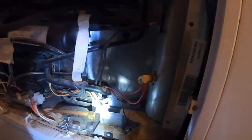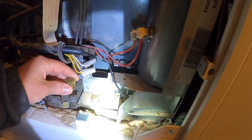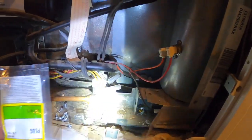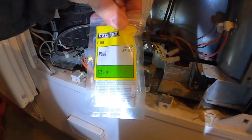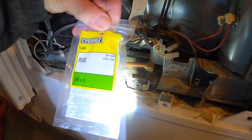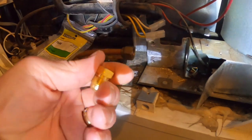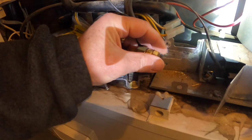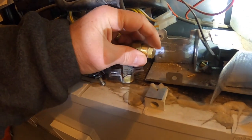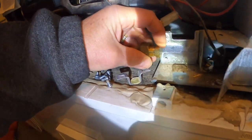The first thing I did — and I didn't video this — is that your propane line basically comes right up here and connects into your ignition valve. Disconnect that, and what I did is bought a 3/8 flare plug from Home Depot. Here's the flare plug — the flare nut goes on there, make sure it's good and tight, and that caps it off. And then you're done.